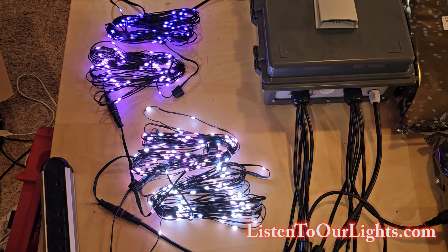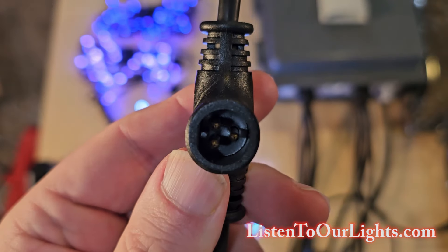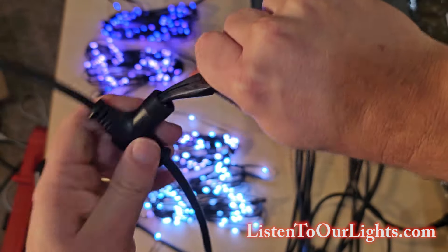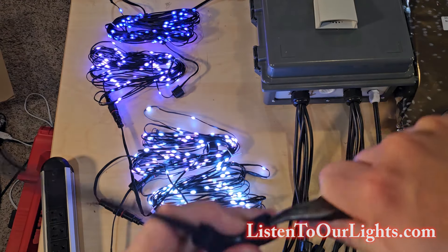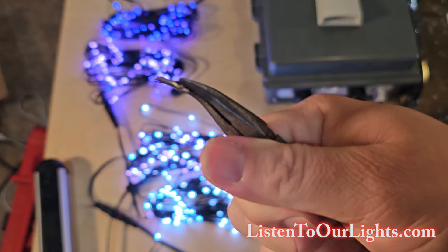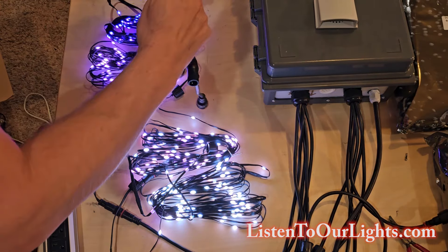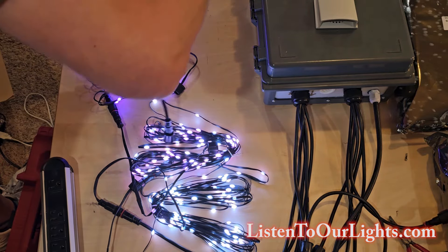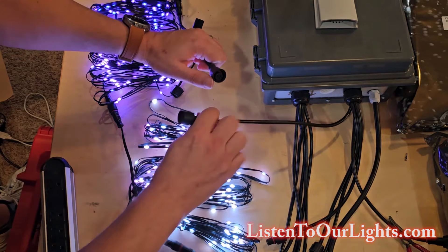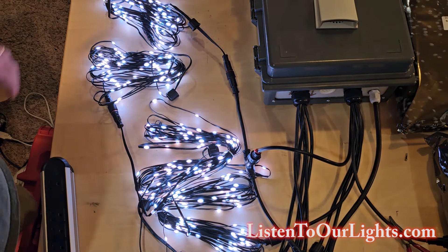If I were to do that — here's a power injection tee right here. It still has the three pins in it, so I've got to get rid of the data pin. I get the little tool in there, give it a bit of a turn each way, and — just like my childhood dentist, who was an ex-navy dentist — just give it a little yank and pop. There's your tooth, kid. So now I put this on the end like this, grab another one of these power connections coming out of my power supply, and I pop it in. And watch — boom. All white. Perfectly white. Everything's good.